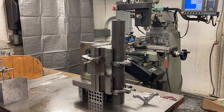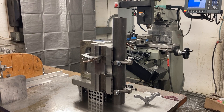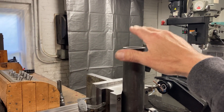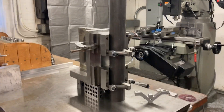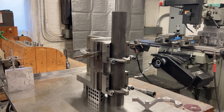I got this job coming up. This is just a mock setup — that's not the actual piece of material. But I'm going to have a big piece of material in there and I have to be able to drill and tap and put dowel holes on both ends, coming in this way and then from the other way. So if I can hold it in the V-blocks and never take it out, I won't lose orientation from one end to the other when I have to flip it around.